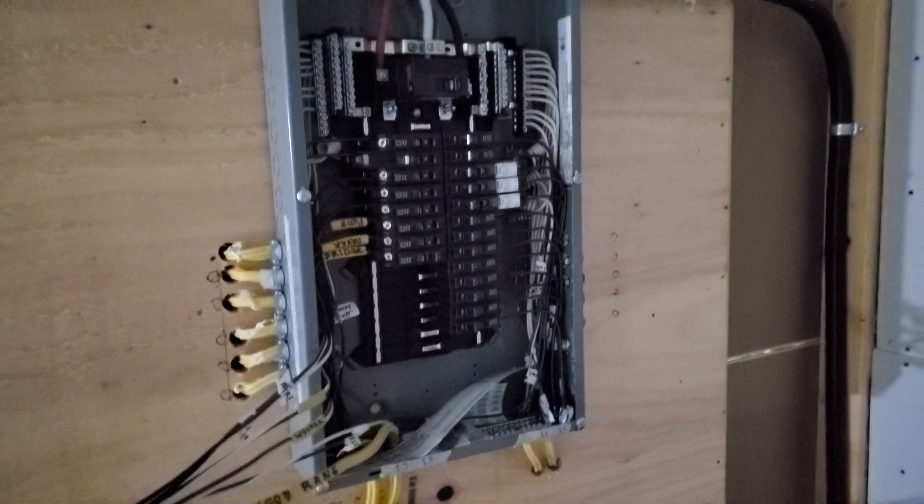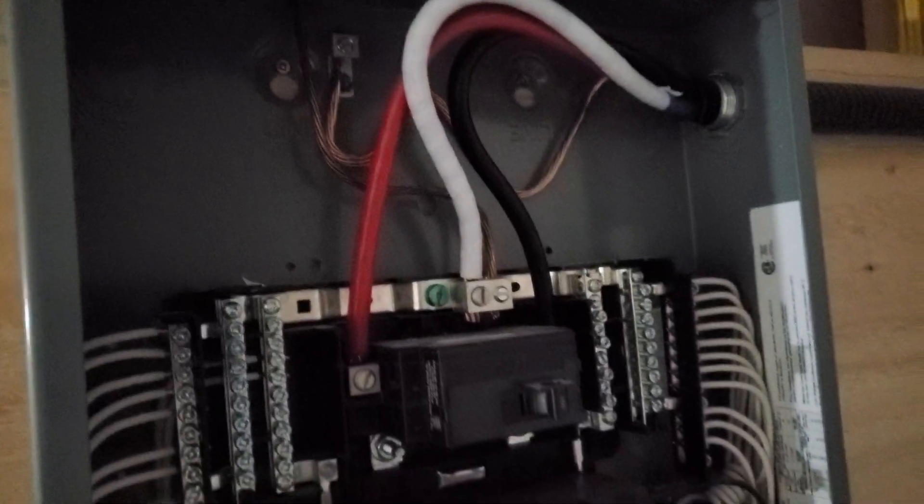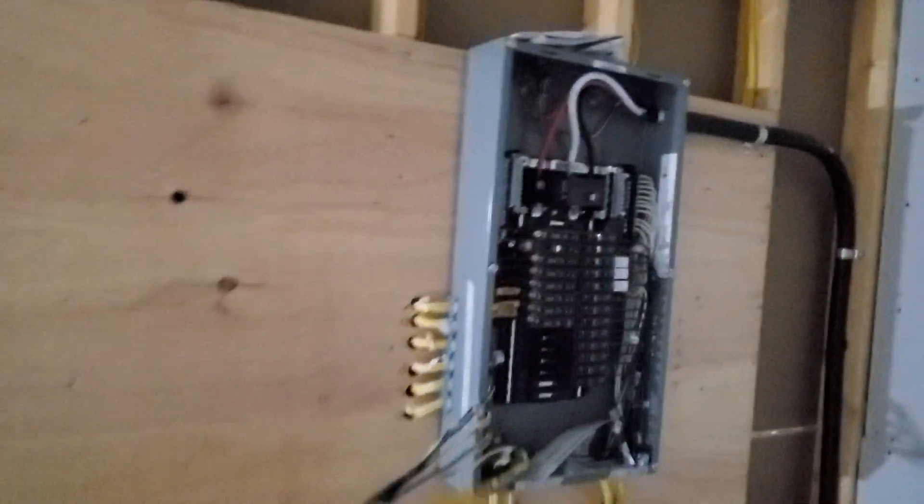So here's what I got so far — everything's pretty much nearly done. I just had to do the number two wire and wire it in. I got that done. That was a real bugger because I'm running it from the crawl space up through here. I had to bend it and the wires are really hard, but it's a really protective cable. Got that nearly done — just five more arc fault breakers to put in and I've done that.